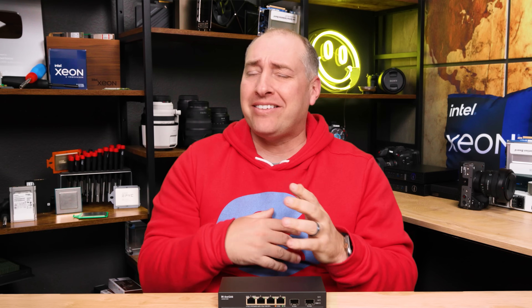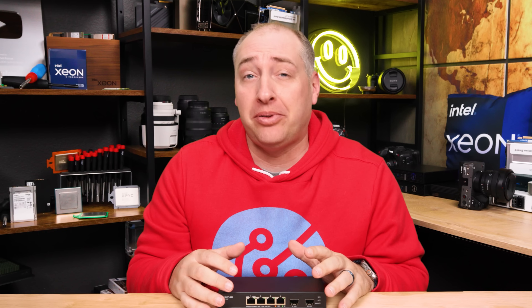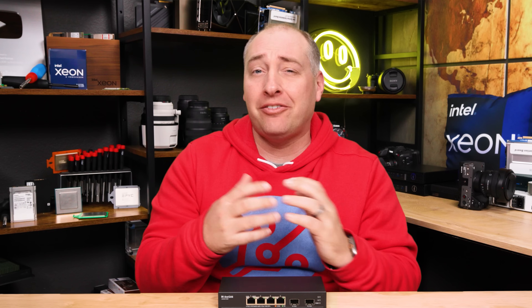We're looking at more than 20 switches today, so let's keep going. Over the past year or so, the four-port 2.5 gig Ethernet plus two SFP Plus switches have gone all over the place — people absolutely love them. Some have trouble with DACs, so using SFP Plus optical modules is definitely the way to go. There are a ton of options and they are absolutely dirt cheap now, and some even have cool little features.